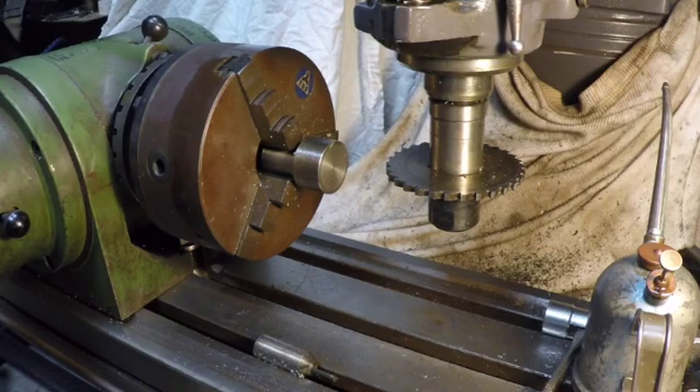I tend to get a smoother flowing cut if I do it right the way through with the center still in there. The depth of cut I'm aiming for is 13/64 of an inch, or 5.1mm. I'm going to be putting cutting oil on there. I've got the 40-to-1 dividing head set on the 18-hole, going four turns with an extra eight spaces. As I'm going, I'm going to be pausing the camera and taking photos — it looks like an absolute mess at first but it really does come good.